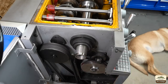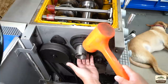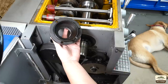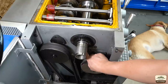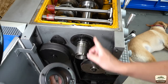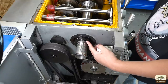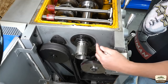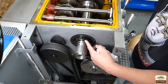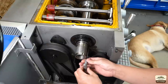Let's take this cover off. This is what the cover looks like. There's a hole at the bottom here that oil drains through — that low spot feeds back into the headstock. That nut is what you use to adjust the preload on the bearing, and notice it's slit so that once you get the load right, you tighten those screws and it prevents from backing out. I'm just gonna release that lock.